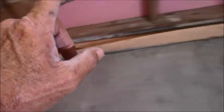My next piece of Kerdi that I'm gonna lay down will be a solid piece that will overlap onto this, probably right up to the edge here. Today we'll be doing my scab in pieces, my 2x6s all the way around, so that I have a nice wall. And I'm gonna treat this same as I would a rubber membrane, and that I use it specifically only on curbless shower installations on a slab.